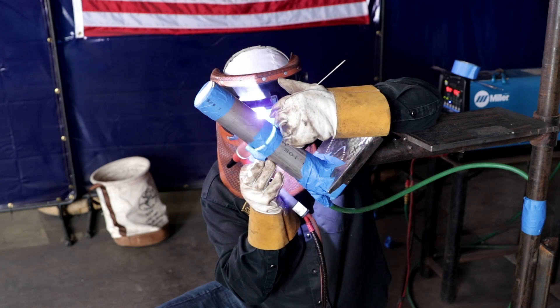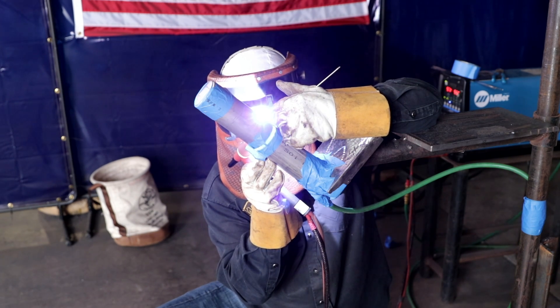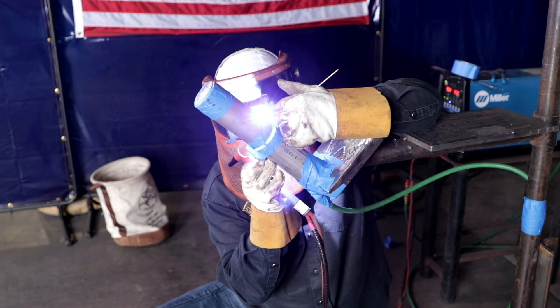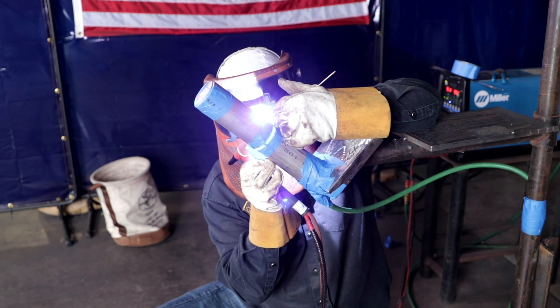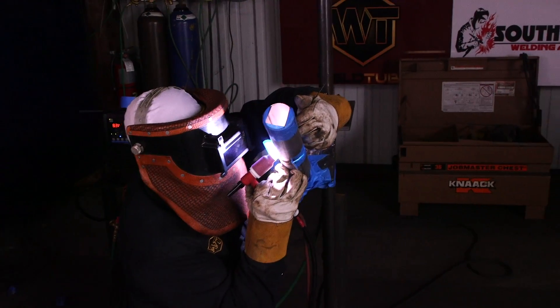Dip dip dip dip. I'm going to weld this up to my bridge tack. This is a really good method too if the gap is closing up on you — you can do this to open it back up. If you prefer to just feed it the whole way, you can do that. I do it too sometimes. Stop right here.